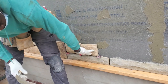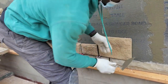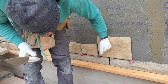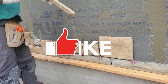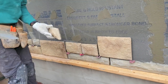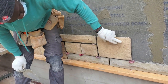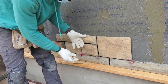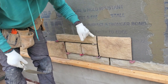Squeeze them on nicely. Put this one right here, squeeze them on nicely, and we have a three-eighths inch head joint. The big size stone — this is the biggest size stone we have here. Once you reach up to the same height as the biggest size stone, you always have to put a stone right across and break it. One of the rules: you don't want to go no higher than the biggest size stone you have. The moment you reach the biggest size stone, you have to put one stone across and break this band.